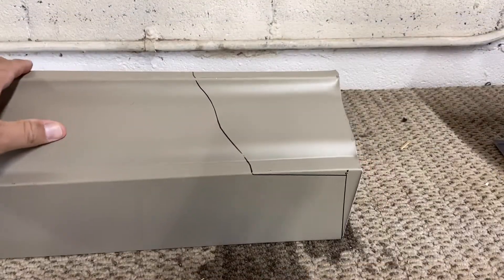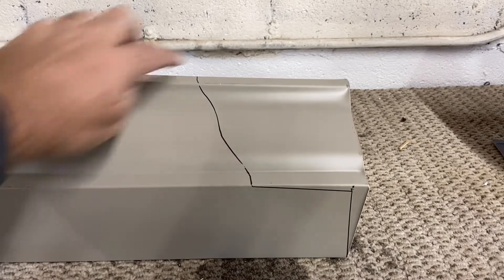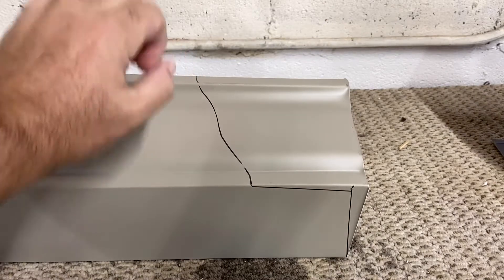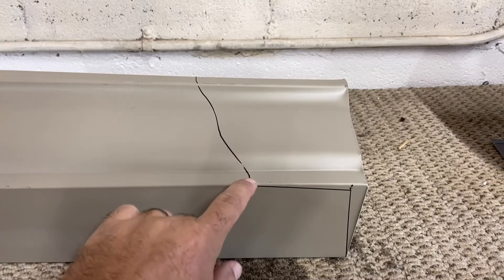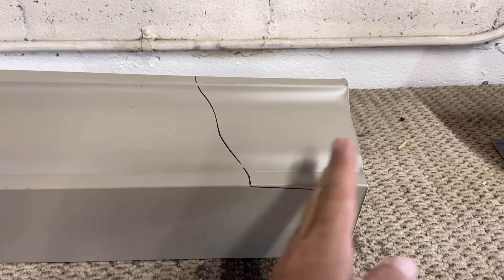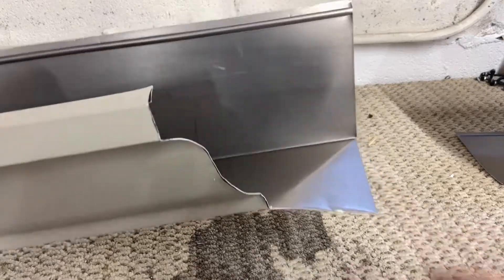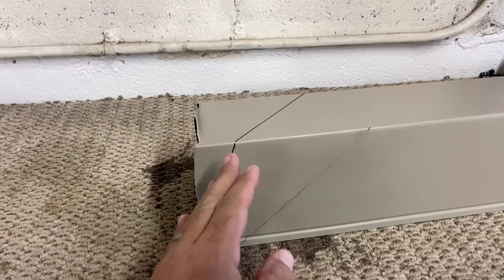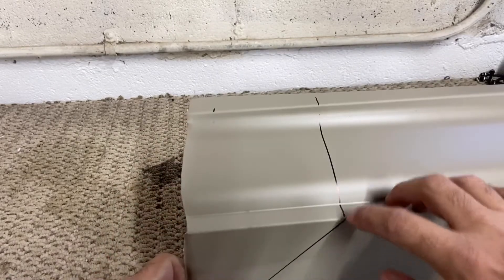This is your upper horizontal section — I went ahead and marked it out. Essentially what we've done is pulled from this corner to here. Six inches — we used our miter template to trace out an inside. Anything from the left of the edge is called an inside. From our upper point, go an inch and a half to 45 degrees and then straight 90 degrees up.